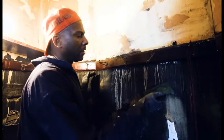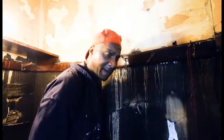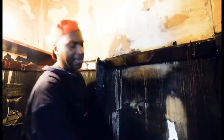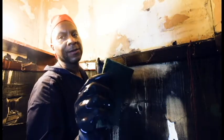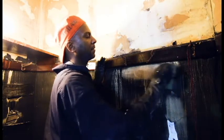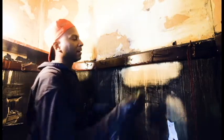I'm going to scrub this closet out. This is the wall that's basically been coated with soot. I have a bucket of water with some TSP — trisodium phosphate. It's actually used as a food additive, kind of like baking soda. I use a sponge that has one side scrubby and the other side not. Basically I just scrub a little bit to loosen the soot up right away before it has a chance to dry back on, then wipe it away.